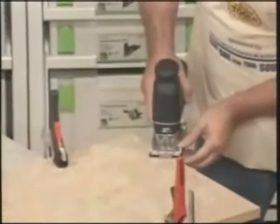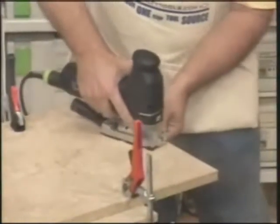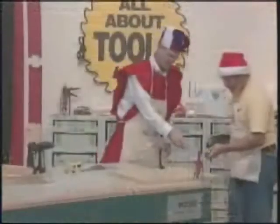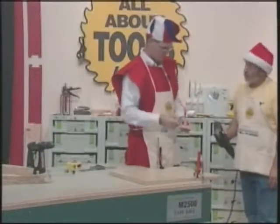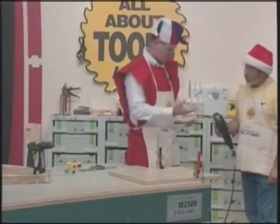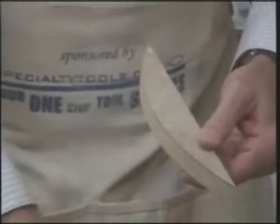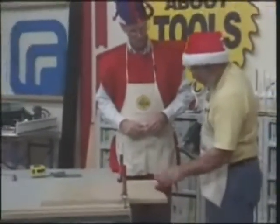So I'm just going to cut a little bit on this board. Okay, now look at how clean that is in plastic laminate. Everybody's got to see that, because I've cut a lot of laminate tops over the years installing them. Now, this is plain high pressure laminate. But if you'll notice on the edge, and you can see it here on both sides, there's not one bit of chip out there. So now, for an installer that does laminate work, especially sink cutouts, that's good enough that if you screwed up on a job and had to cut something off and re-edge band this, that would almost work.